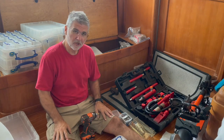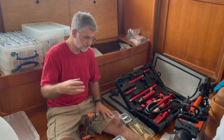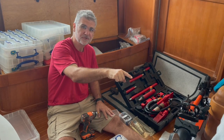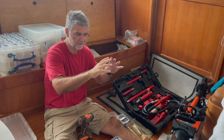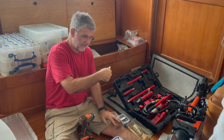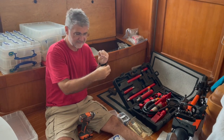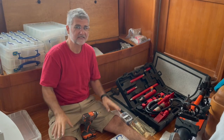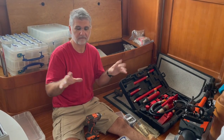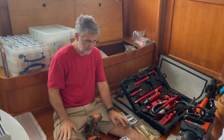So you saw that I took the stuffing box off and I showed you a picture of the stern tube, where you could look down the stern tube and see the Cutless bearing. So I went down below and I took out the set screw that holds the Cutless bearing in place, and I tapped on it a little bit and it moved. So it doesn't seem like it's glued in there. The previous person who put it in just pressed it in.